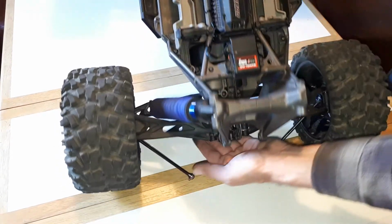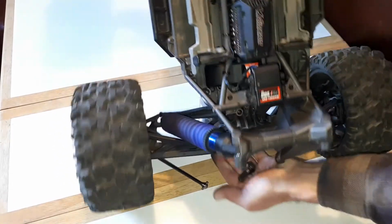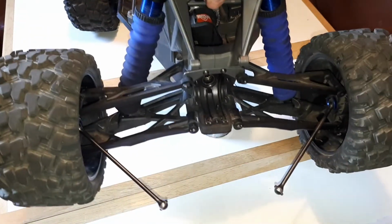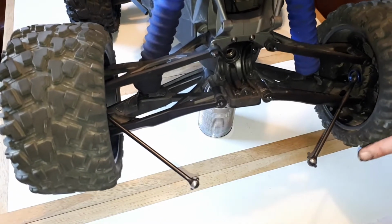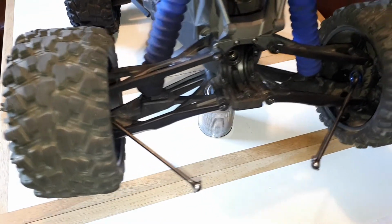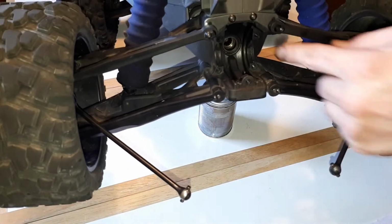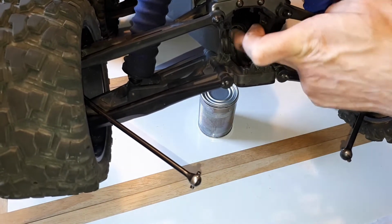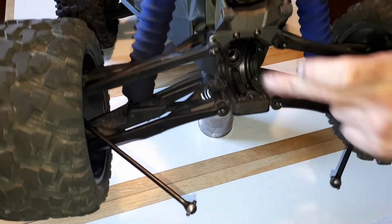And to get out the pinion, a little bit of a shake. And normally, because I knew this was already broken, I've already had him apart once just to check before I got the parts. But normally, you need to give it a good clean. Be very careful not to get any bits of metal inside there. So just be very careful, and then wipe it all clean.